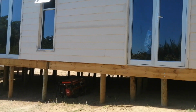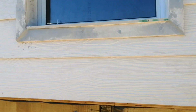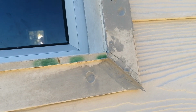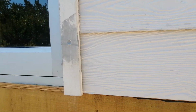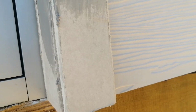So for example, let me explain how it works. When you do the framing of these strips, there are obviously gaps in between. These are very tiny gaps. Those are the ones where we fill the fiber seal. And then when you paint over the fiber seal, these marks are not going to be visible. So you mustn't worry about these marks at all, because once you paint over, when it dries, it's permanent and it's just sealed permanently.